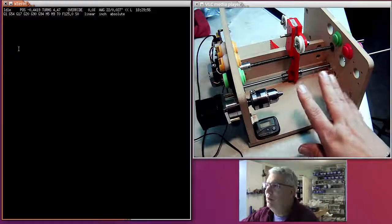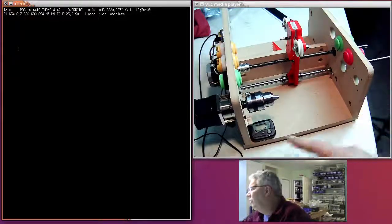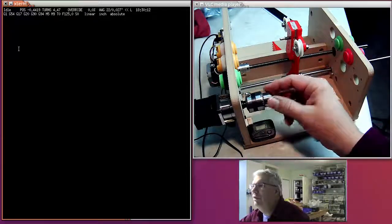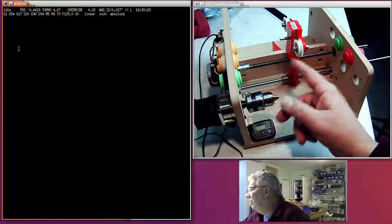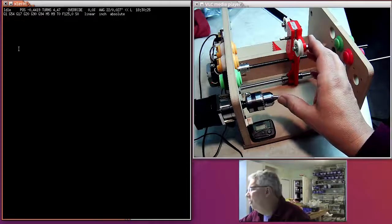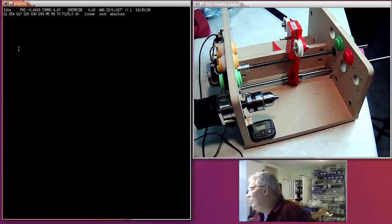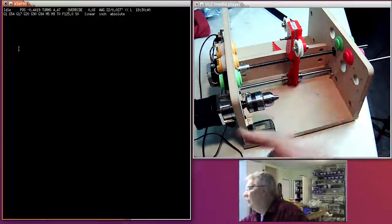When you're spinning the spindle with the green button, the X-axis actually moves in synchronized fashion — this is my turns axis. It uses GRBL jog and jogs both axes at the right rate. What is the right rate? It's based on the wire gauge you set in the Python software. It's currently set to 22 gauge, so when I hit the green button you'll see the X-axis moving just a little bit while the spindle rotates.